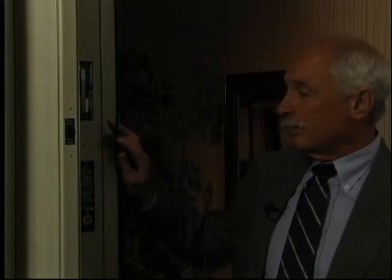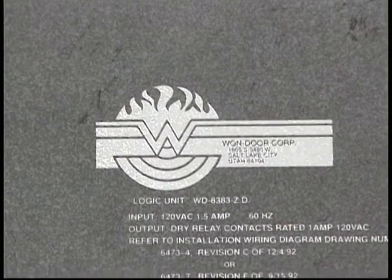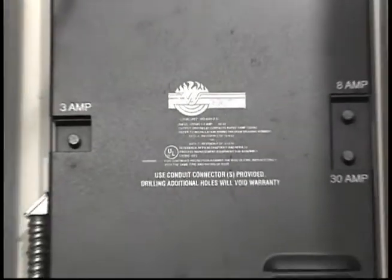The listing procedure allows for standard labels to be attached on doors up to the size tested, and oversized labels for doors not exceeding 23 feet in height with no restriction on the width. The label is attached at eye level on the lead post. The label on the automatic closing system is attached to the metal box housing the microprocessor, the battery, and the battery charger. Typical locations for this box are either below the header area in the storage pocket or above the header at the stack end of the door. The location of the operating system in a fire-protected enclosure should be shown by the architect when drawings are submitted for plan review.